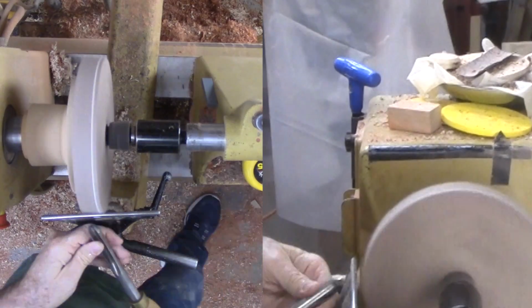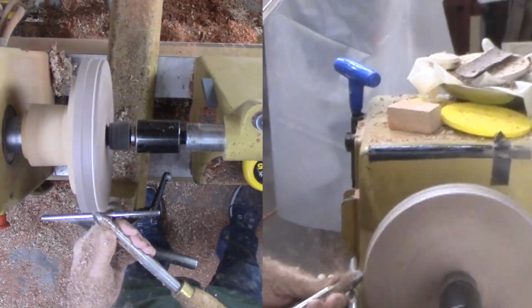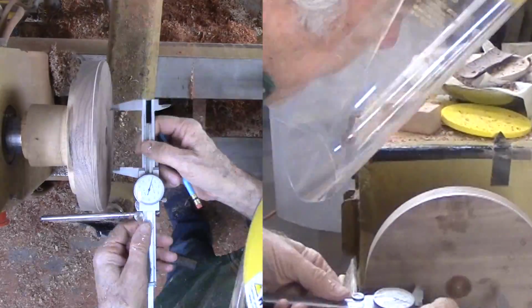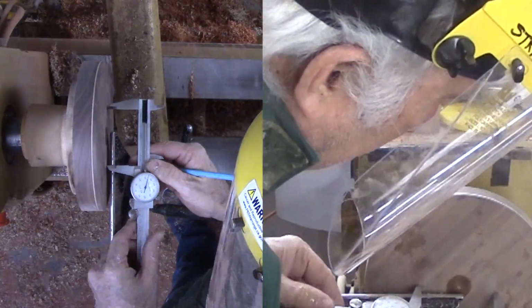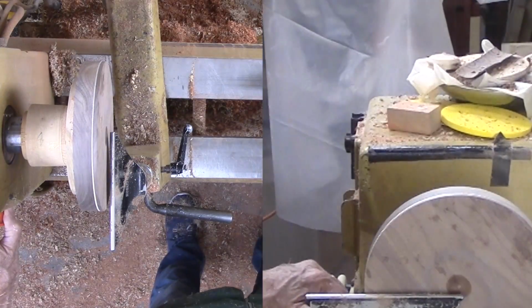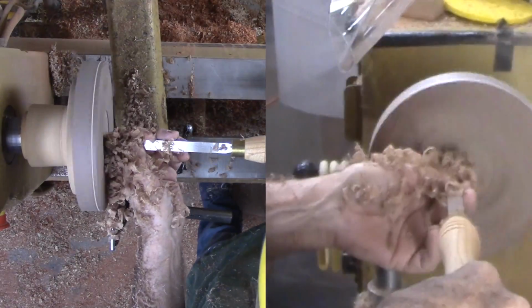First task at the lathe is to trim the perimeter. Then lay out marks sized for the center mortise. This is not a tray, so I'm using a set of medium-sized jaws for a smaller mortise. This is mostly done with a box scraper, but fine-tuned with my skew.